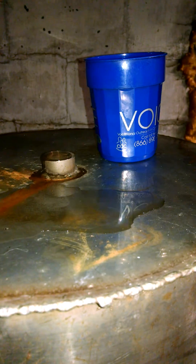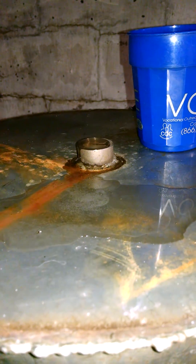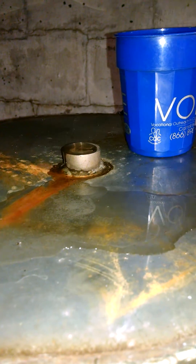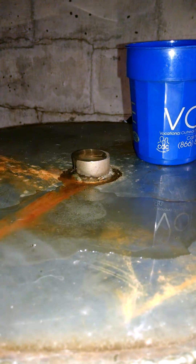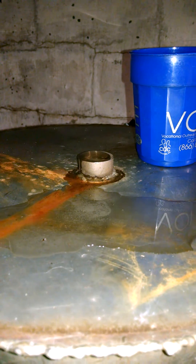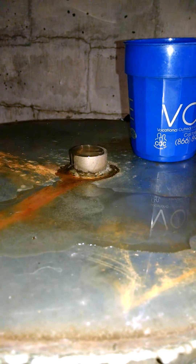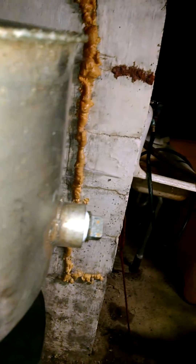The water's getting pretty hot. There's a little expansion there at the top. I'm going to put a tube or a pipe on there and run it upstairs, and that pipe upstairs will have a container on it. That way we can watch the water level down here in the rocket stove when we're upstairs. This thing's radiating a good amount of heat off of it.